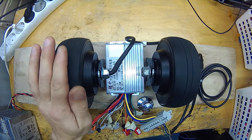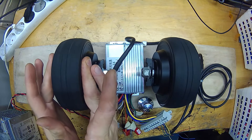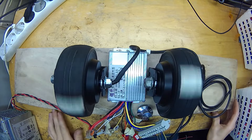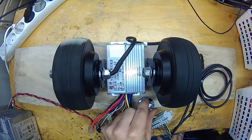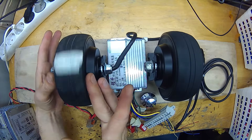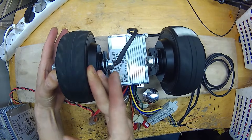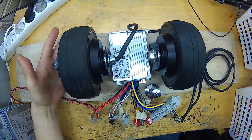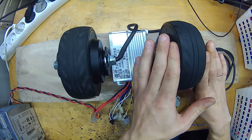This works because they are identical — they share the same size and configuration of windings inside the motor. So the slave is receiving power pulses at just the right timing, although there is actually no feedback coming to the controller from that slave motor. When I slow down the slave motor, it drops out of phase, resulting in trembling. When I slow down the master motor, it just slows down the slave motor as well.